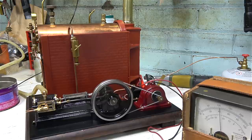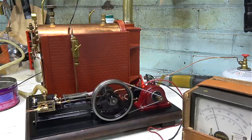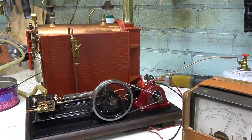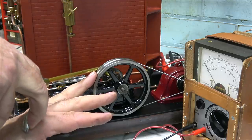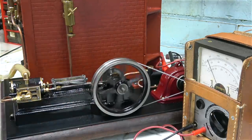I'm fitting the original chimney in place — the small hole is where the steam originally went in. I'm going to route the exhaust pipe up inside the casing to the condenser, enlarging the small hole to take a steam union, with a steam pipe to carry the water away from the base of the engine. I'll leave the engine running so you can see it. The pressure's almost gone now; I oiled it up with steam oil and it's still running and generating a small amount of electricity.